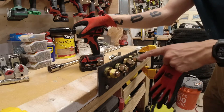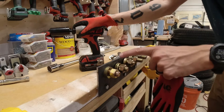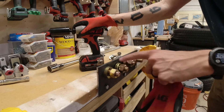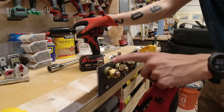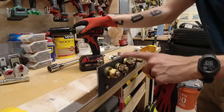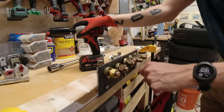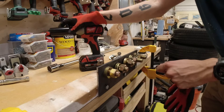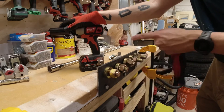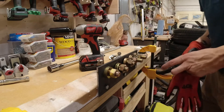After the fastening test, we'll do the breakaway torque. I'm going to tighten each one of these bolts to a certain foot pound rating — starting around 100 foot pounds and jumping up by about 5 foot pounds. If we can break it away in five seconds or less, we'll keep going up until we can't break it away anymore. That'll be what we consider the max breakaway torque.